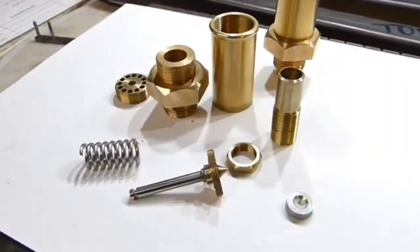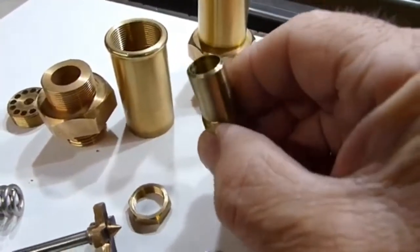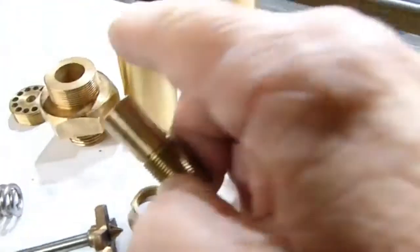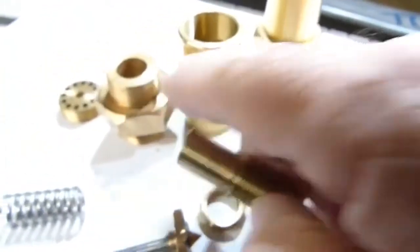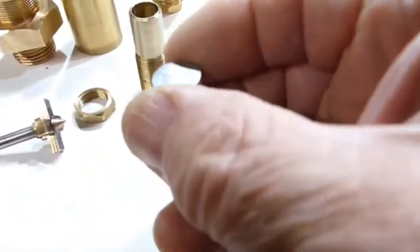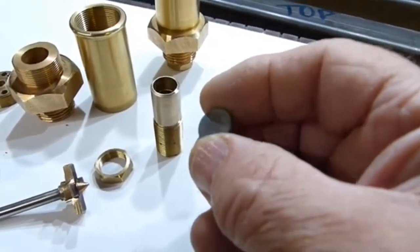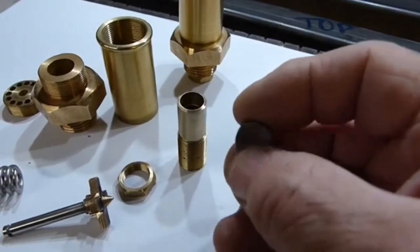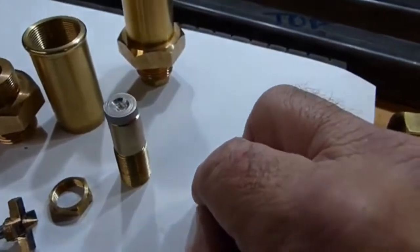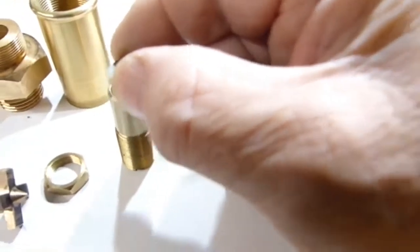Here is a safety valve disassembled into its separate component parts. This is the actual valve seating, which is adjustable — it can be moved in and out until it's approximately 6 thou below the surface of the body. The flat valve has been lapped to a very nice smooth surface. It was lapped with different grades of emery, then finished off with superfine lapping compound, followed by a tiny amount of metal polish like Brasso, lapping the top face of the valve.